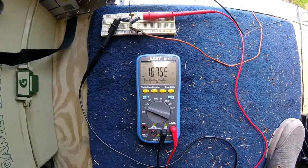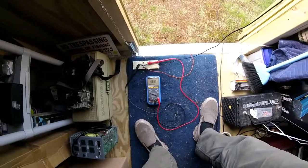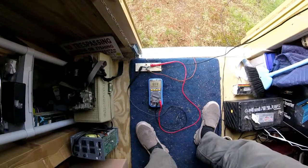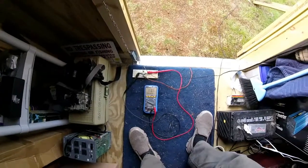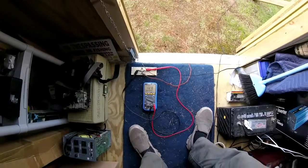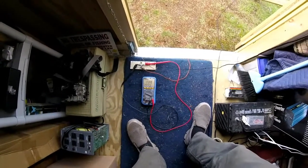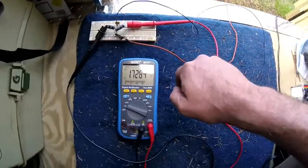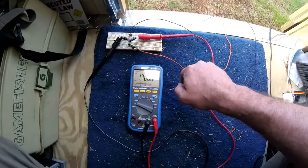As I bent down, it slowed down. I'll stand up. As I stand up fully extended, the voltage increases faster and stronger. It's interesting. My guess is it'll probably go as high as the capacitor voltage, because I'm sort of isolated with the diodes — isolated from the capacitors. So I'm guessing it'll probably go up as high as the voltage of the capacitor, if I had the time to stand here all day. Bending back down is going to reduce the amount of voltage. See, it's dropping. All I've done is bent down, so I'm definitely making a difference.